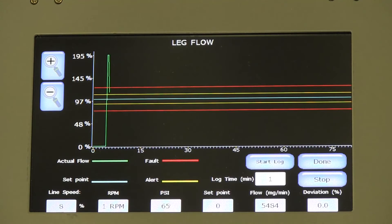The AltaBlue Touch Melter enables pressure and flow monitoring and control through optional control boards. Being able to monitor the actual pressure and flow of adhesive, as well as set predefined acceptable upper and lower level limits relative to both parameters, provides an unmatched level of visibility and understanding of material delivery and dispensing.